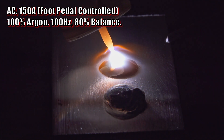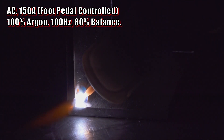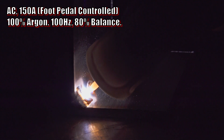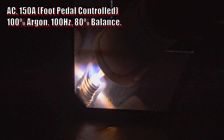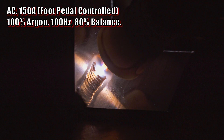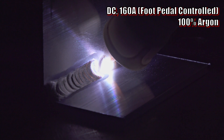You have to watch for ripples and wrinkles in the surface of the aluminum to gauge how much is melted beneath the surface so that you can know how far that molten area goes. It's really hard to direct the puddle, so if you're running a T-joint it's tough to avoid undercut on the vertical portion because the metal wants to just kind of flow and drop down. It doesn't want to stay where the arc is directing it.